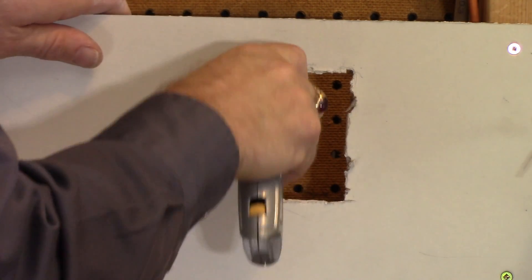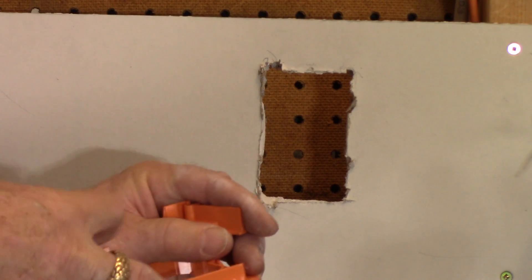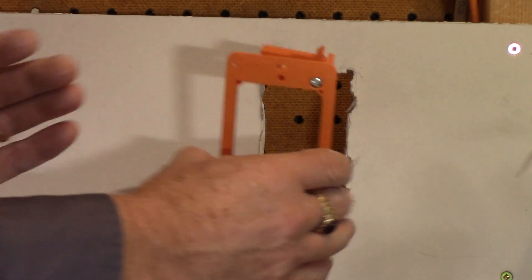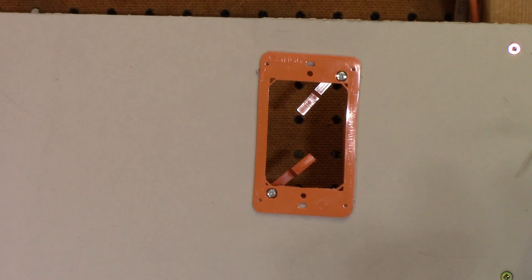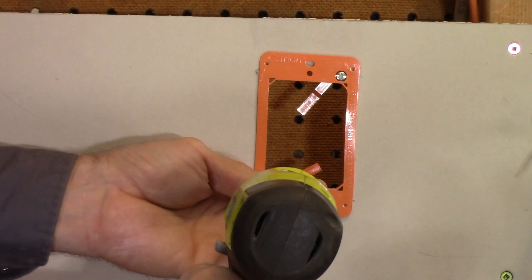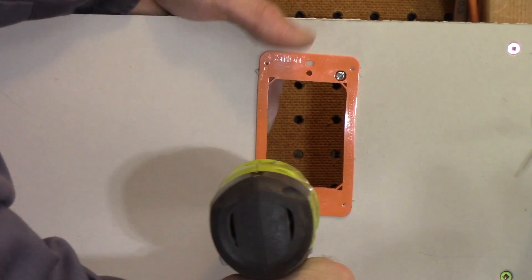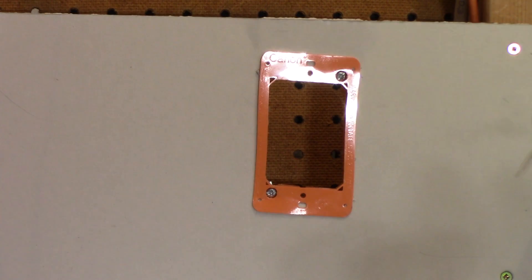We need to mark this one and make the hole a little bit wider — just fine tuning with the utility knife. Make sure the tabs are in. If it was a device box they would just go up against the sides, top and bottom. Put it into the hole, snap it in tight, and then with a Phillips driver — I am going to use my cordless drill. You won't have the luxury of reaching in behind your drywall, but the little wings clamp onto the back of the drywall and that low voltage ring is firmly in place, as would be a full plastic device box.